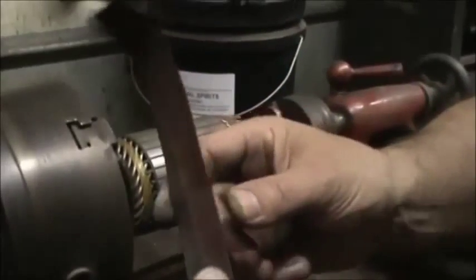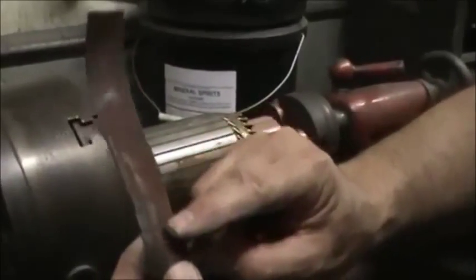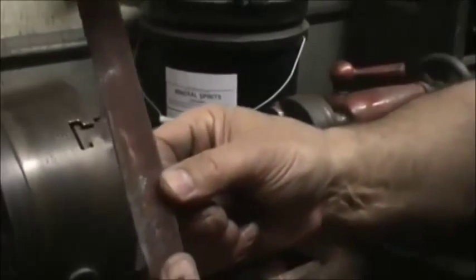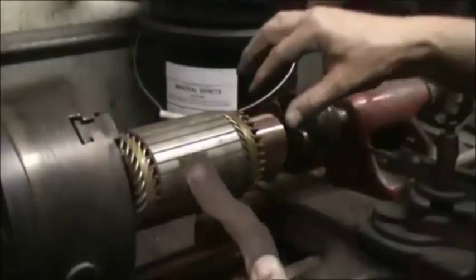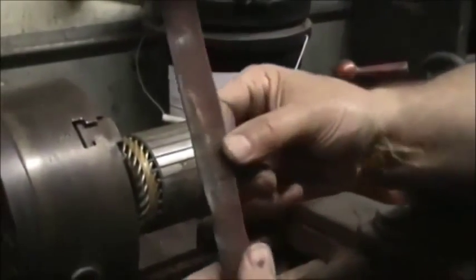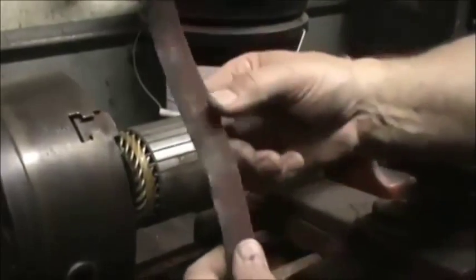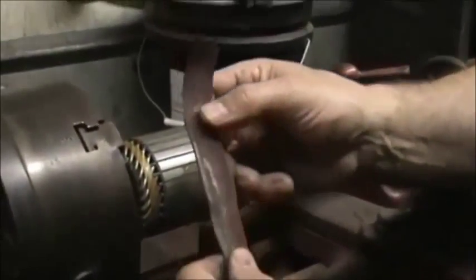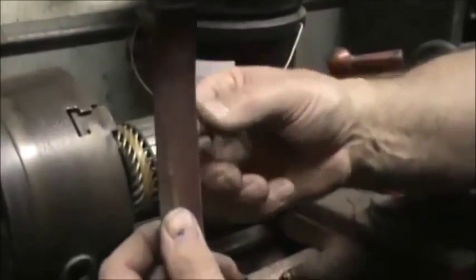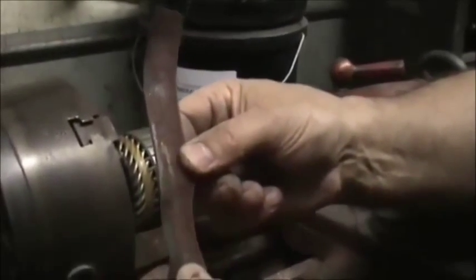As you near the end of the polishing process, finish off with a piece of sandpaper that has some copper already embedded in it, because the glue in the sandpaper impregnates the copper and you don't really want to finish off and leave that glue in the surface of the commutator. It's not a severe case and not an absolute requirement, but you get a lot better results if you finish off with a portion of the sandpaper that already has copper in it.